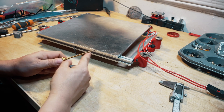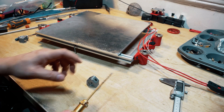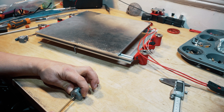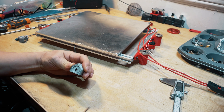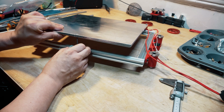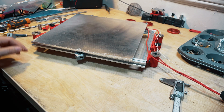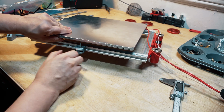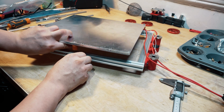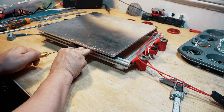I got this screwdriver and I'm going to heat it up on the stove, then melt the plastic down by holding it through the hole and pushing straight down. I only kept it for about 30 seconds over the flame. That should melt it and I can sand it down or do a little bit more if needed. Let's see how this fits now — put it in there. Boom. One, two, three. Tight, it's not wiggly. Put the little pad on there, then put the mount, get my nut driver and screw that in. Really good to go.